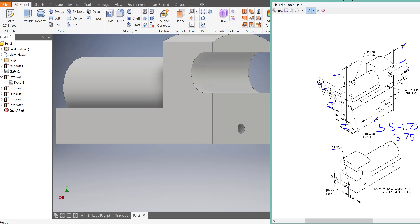We've done that, that, and that — but we haven't done this one yet. We've done the stuff in the back. So let's put in these two circles. There's a weird notation: 1/4-20 UNC through, times two. What this means is that these are threaded holes.